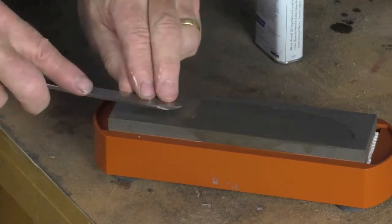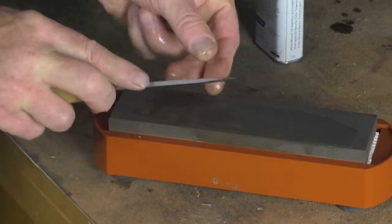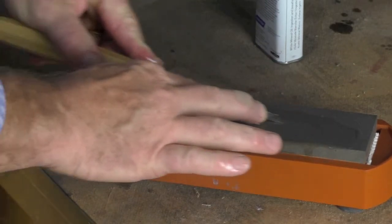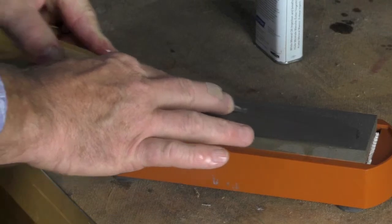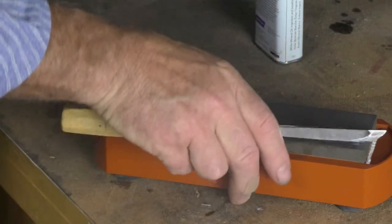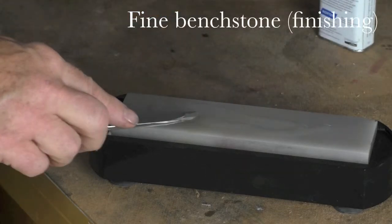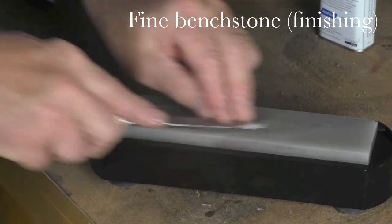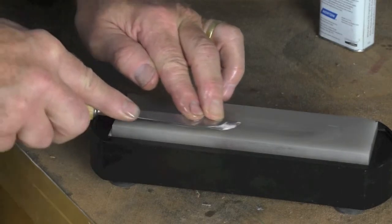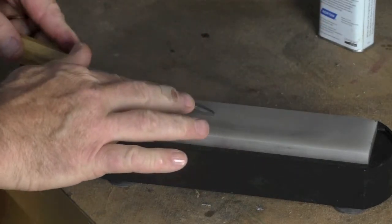I'll see if I can get that all merged together. The edge is fairly well sharpened already — it's quite close. And for once we get to lose the corners; I'm always saying keep the corners, but here's a case where we're actually making a rounded corner. When I've got that nicely merged, I'll swap this stone for my fine stone — more oil. This is a translucent Arkansas, but any stone will do. I'll sharpen this edge exactly the same way, coming to the tip and around, dropping the handle so that all that edge from here all the way around is sharpened.